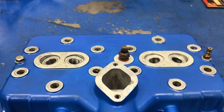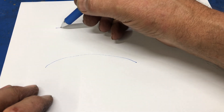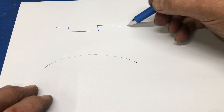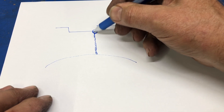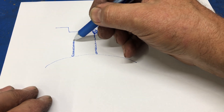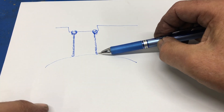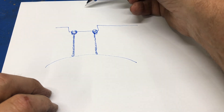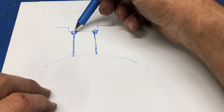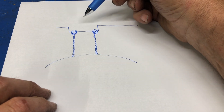So what are we actually working with? Let me make a little drawing here. This will be the inside of the combustion chamber and the spark plug goes there. Let me draw some threads up one side - they're all mashed up and damaged at the top. We have a nice thread down here and it's damaged at the top. All of these threads right here are perfect. It's only damaged at the very top. You could put a tap in there, but if you don't catch it in the right place up where it's damaged, it's not going to match the threads down here and it's just going to make a mess.